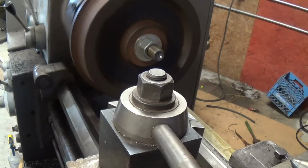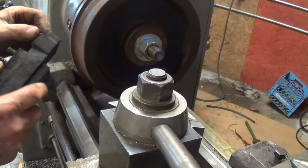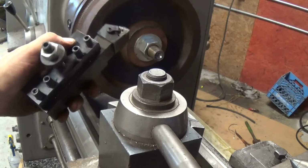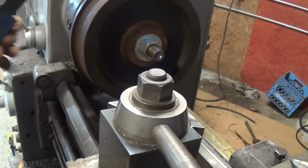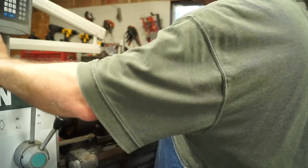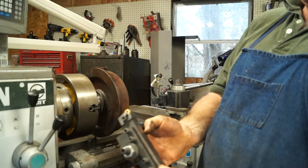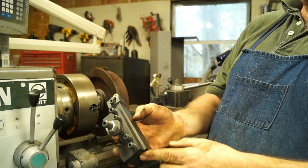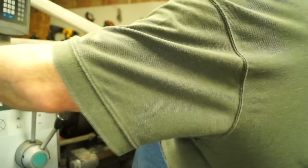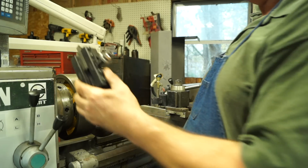We're going to use 3 tools. First tool we're going to use is a WNMG. This particular holder and this tool I got from Dennis Nolan at Niagara Cutter. And thank you, Dennis. It runs real good. So that's the first tool we're going to use. The next tool is this radius cutter. This is a Hurdle, 1040 M, RGNL 1040. It's got a 1/4 inch radius, and we'll use that to cut the radiuses. And then the third tool is this ground cemented carbide, and we'll use it for all the radiuses. We'll have to flip it over to the other side when we get to that point though.